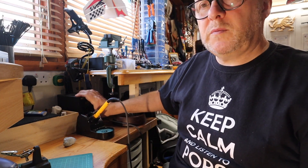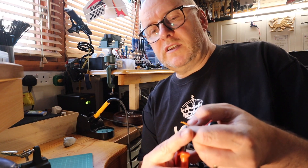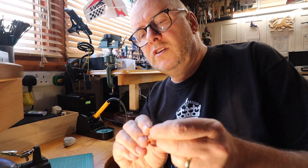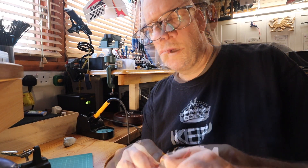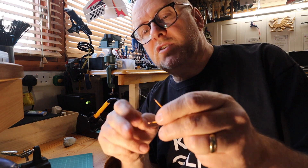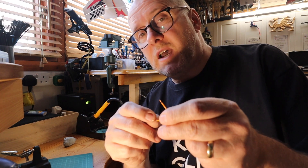We'll do an exercise where we join the cable. Some people will use side cutters and strip it back. You can also, if you've got a knife blade, gently score the wire by rolling it over the sharp edge. That gives a nice cut. Obviously you don't want to be cutting into it — you only want to score the PVC outer, not the wires inside. Score the wires and they'll snap.